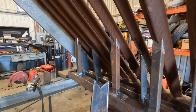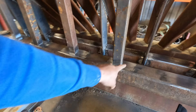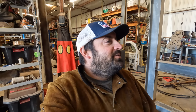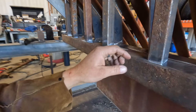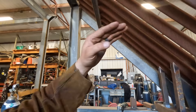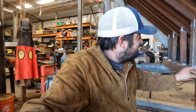A lot of grinding, a lot of cutting later — we've got pretty much every vertical piece cut, all the edges ground down clean for the most part. I went ahead and ground down this main bar just a little bit more, got it kind of smooth and clean, got a real nice good weld. I was getting ready to start tacking these in place and getting things squared up, then I realized there may be a slight issue with how we're doing things. When I built this, I think I built it pretty square, but I don't know exactly for sure that when we take this bar and move it up top, the three-inch bars that are up here are going to line up perfectly. So I'm not going to weld the bottom ones completely 100% — I'll just do a very heavy tack in each corner. When we lift it up to the top I can probably bend it a little bit if it's not too much. Everything's always a work in progress, so let's get these tacked in place.